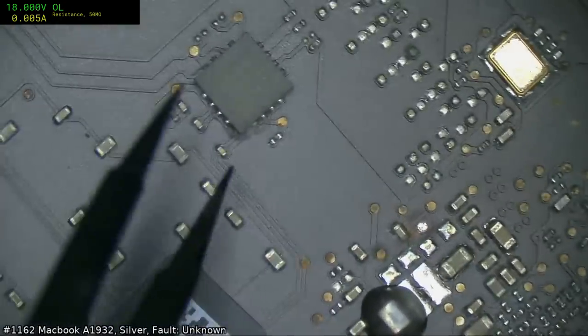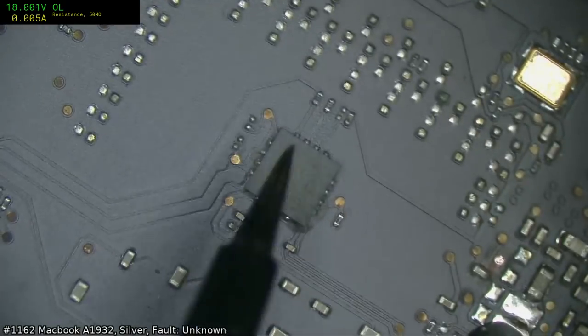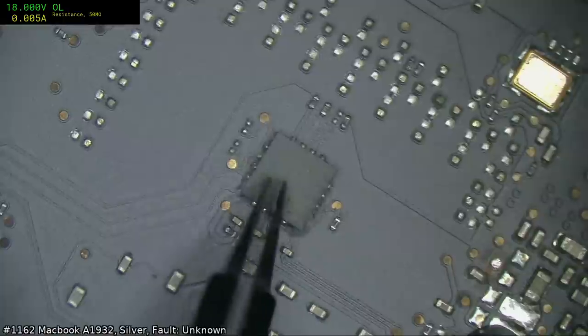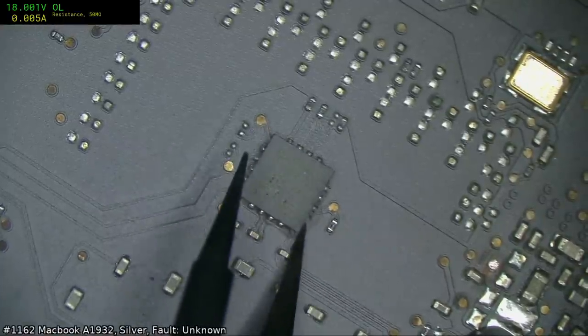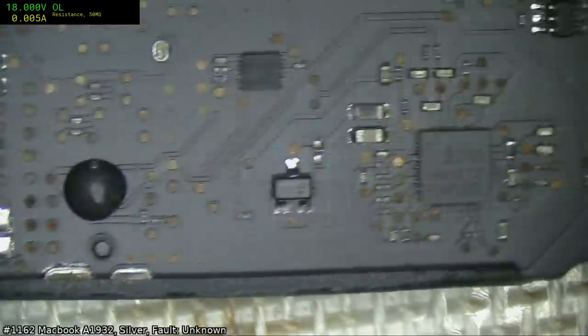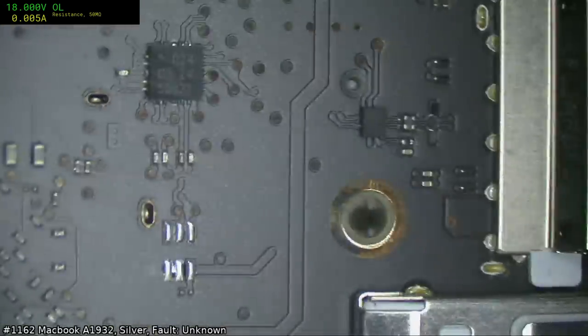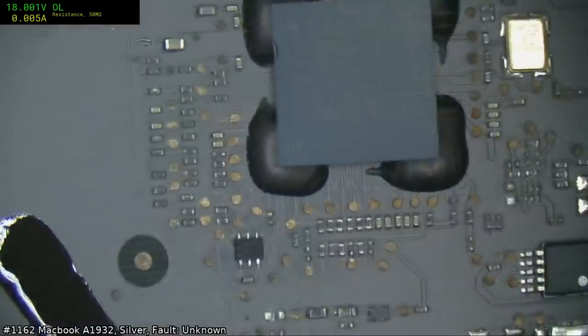Oh, I just noticed that a corrosion there. This here is the temperature sensor. So I wonder if that, I'll test to see if it boots now, but if it doesn't, I do wonder if maybe that, depending on what that pin is, it might be telling everything that, nope, we can't turn on, we're on fire. In which case, it probably belongs in a printer, so it can tell the printer server that it's on fire. Such a signal does exist.